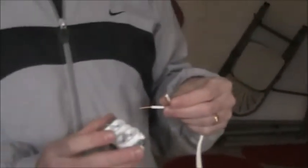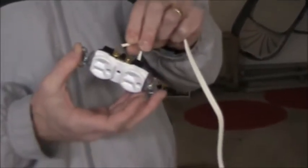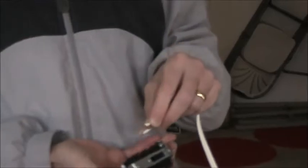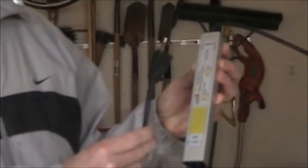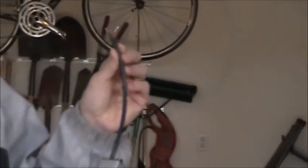So we'll have our little outlet — once we put it in our junction box, we'll wire it up and just hook our wires, one on each side. Next thing we're going to do is take our LED driver. We can plug the AC end into the power provided by the lightbulb from the garage door opener, and the other end will be our 12 volt DC that we plug into our LED strip.